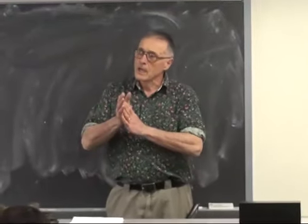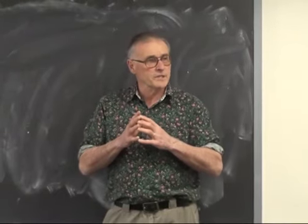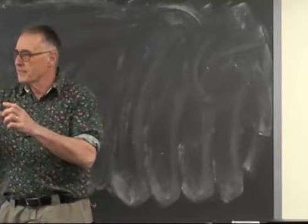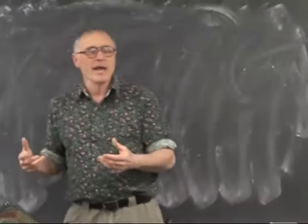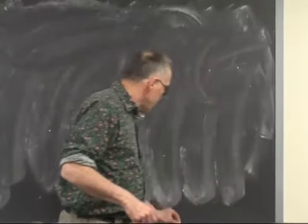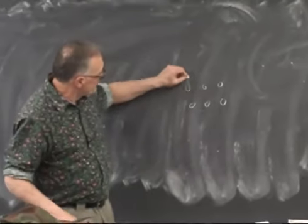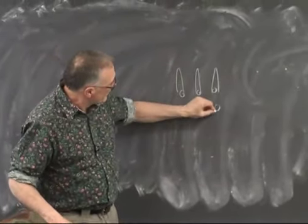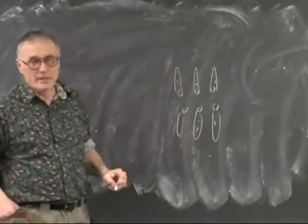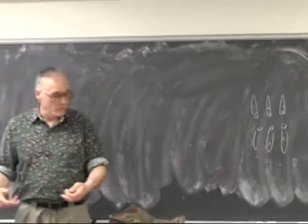I got about 50 solder boards in today. There's two sizes. They have the same connection pattern as the white boards, except they're in solder format. So it's a set of holes set up for P-dip, and then a bunch of connectors out like this for soldering to. It makes translation from whiteboard to solder board very easy.